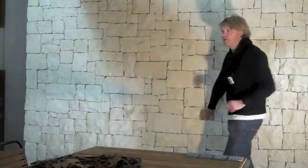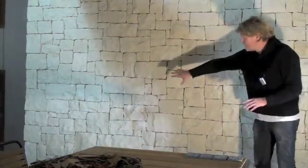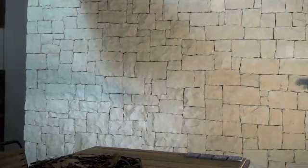You're not going to go too high because you're really wanting the tile adhesive to set, and so they go across the wall, and probably on the first day we got up to about this sort of height, and then the second day up to this height, third day to that height, and the fourth day was more cuts and detailing.